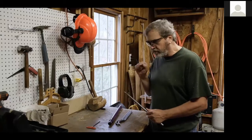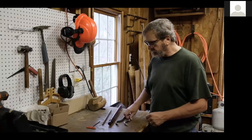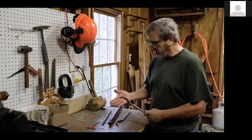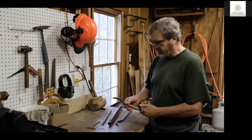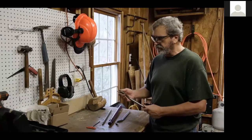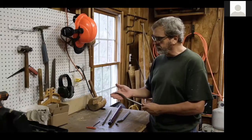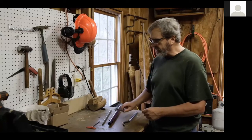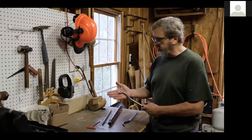Normally you would use it on a deeper hollow form to go straight into the bottom and clean it out to give you room to use the bent tool, this bent tool, which is meant to ride on the tool rest back here. The tip is in line with the axis of the bar. And then the cut, this bent tip can reach around under and dig stuff out. And after we're done hollowing, using this to hollow out the piece a little bit, then I'll come back and grab this tool, which is a scraper, which is just, you know, to cut ever so slightly just to smooth out all of the rough turning that you did.